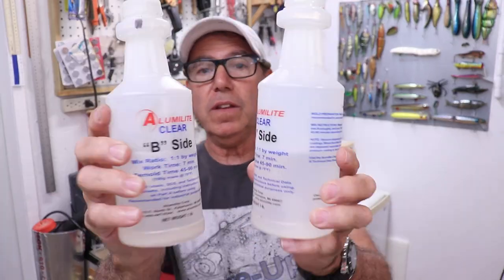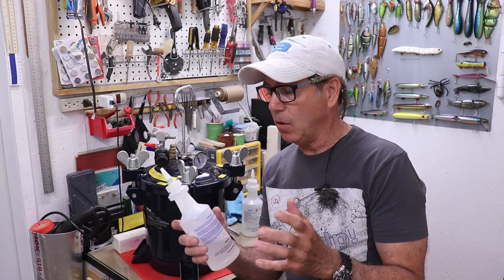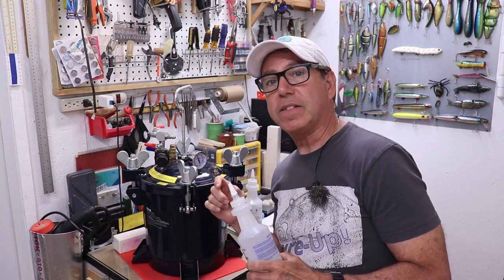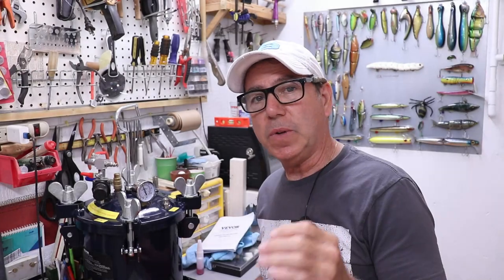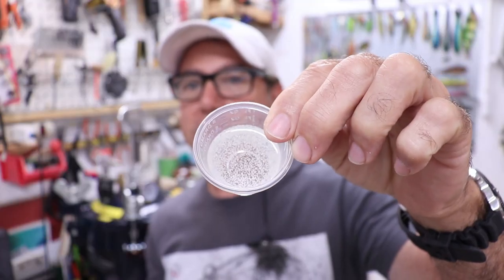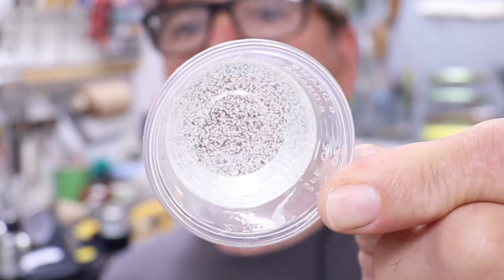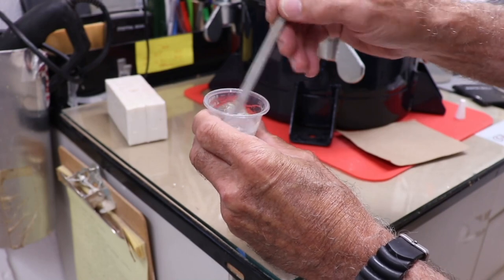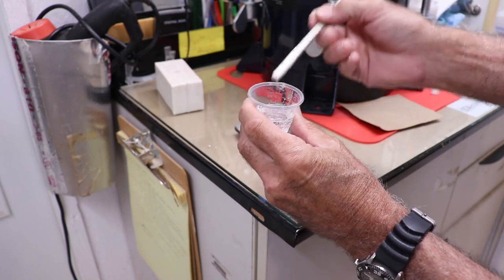It's about time to actually put this thing to use. We'll make a casting using Alumilite Clear — I'm not sponsored by them but they make a good product. This stuff sets normally in about an hour, but with the temperature in the room it's actually setting up in about 30 minutes, so I'm going to have to hustle to get it mixed, in the mold, and pressurized before it starts to harden. Before casting an actual lure, I want to test how well this shrinks bubbles, so I cast a little bit in a small cup so we can see what it looks like without pressurization. We'll mix a batch — use a metal rod, not wood — trying not to churn too many bubbles into it. All right, that should do it, I'm going to put it in the chamber now.